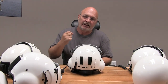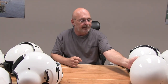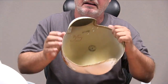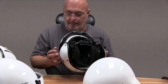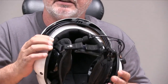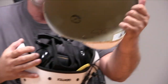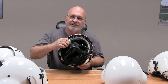The second thing to look for — and we've been finding a lot of these in line — is a soft shell. What I mean by that is shells that were made but they're basically elastic. That's not a proper shell. You're not supposed to be able to squeeze this thing like putty. The way you can tell if you've got one of these shells is to take the helmet and at the ear cups, just squeeze. If you can squeeze that much into a helmet, especially here, and then look inside the helmet shell — it's probably yellow — then you need to send that helmet in for repair because the shell needs to be replaced. That's not a safe helmet.